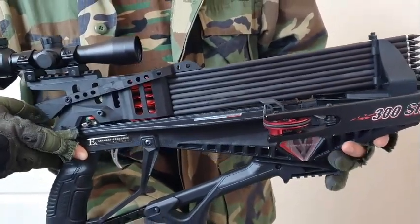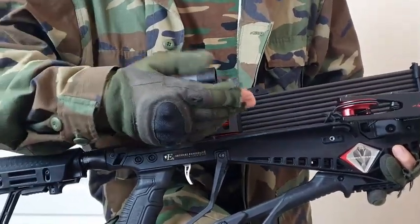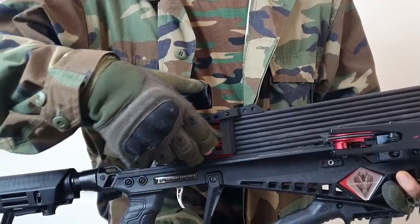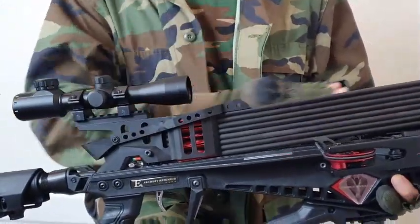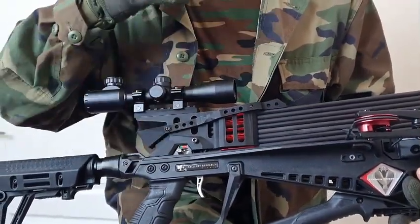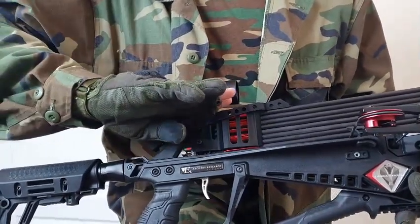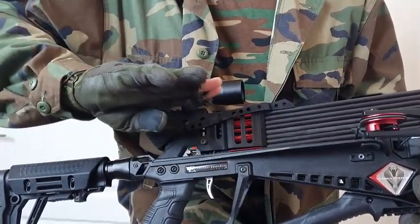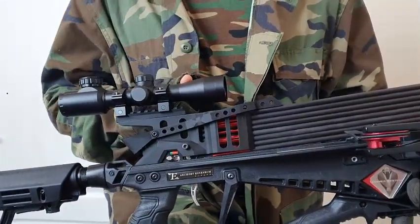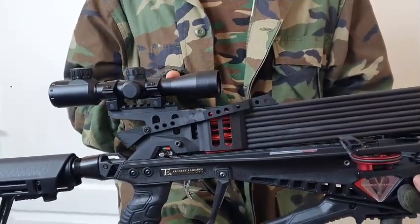So, next thing I want to tell you is about this Picatinny rail. As you might notice, there is a big elevation, and there will be challenges with zeroing the firing line and the aiming line. So for that reason we're gonna ship it in two alternatives. One Picatinny rail would be absolutely parallel to the magazine surface and to the shooting line, and one will be converged by 1 degree, and as a result this would give zeroing at 10 meters for standard optics.